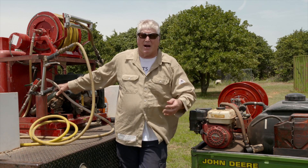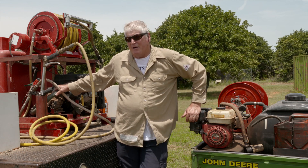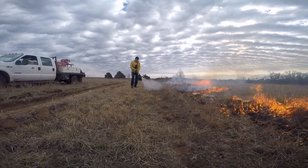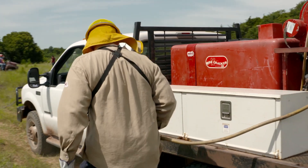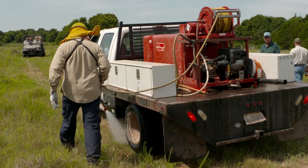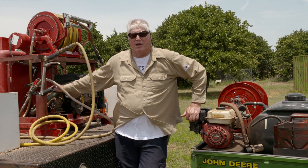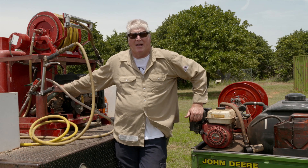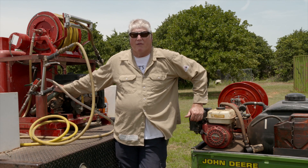High pressure and low volume conserves water — you can control a fire with lower volumes as long as your pressure is up. We generally run these at about three-quarter throttle, generating around 450 PSI and putting out about nine gallons a minute. That's a good compromise, similar to many cattle sprayers. As long as you get pressure up around 400 PSI or above and put out nine to twelve gallons per minute, that's an adequate primary sprayer for a prescribed burn.